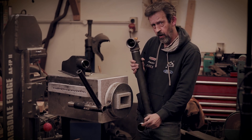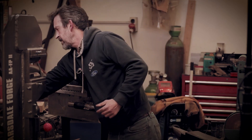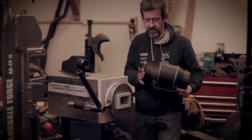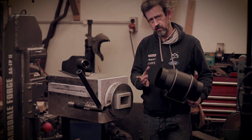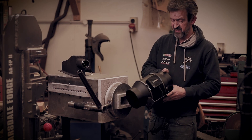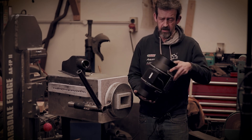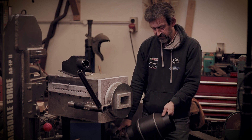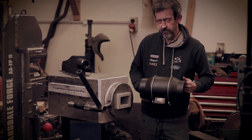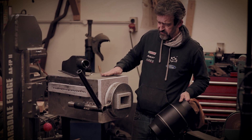This is the pipe that goes down to the blower. I'm going from this 60-millimeter pipe and the blower is six inch, so I need to make a conical shape adapter — that's today's job. This is a fan from AC Infinity; not 100% sure this inline fan is going to work but I'm going to try it. It'll get mounted down to the frame; I'll need to weld a cross member between the legs and it gets bolted on. We're not too far away — just these few little bits to do, and then obviously it's got to look good.